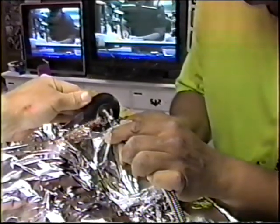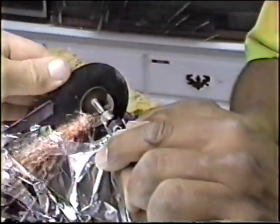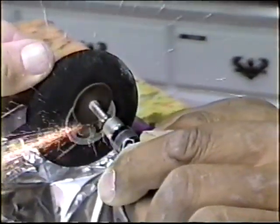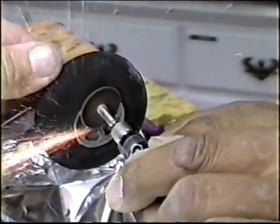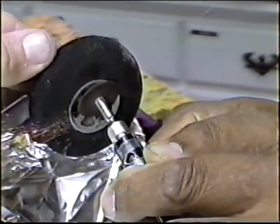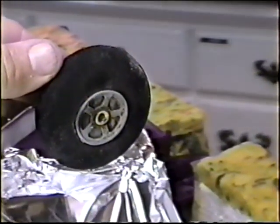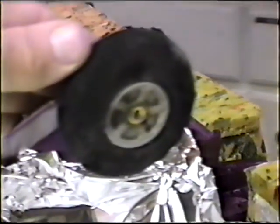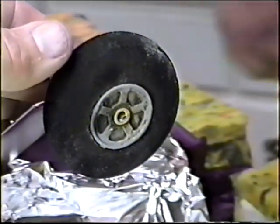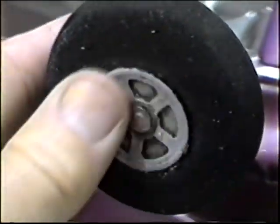Last time he did this, he cut his finger off. That's the heavy duty wheel. See how that cuts so nice? That's a good one. Doesn't that cut nice? Yeah. Just go slow, you don't have to go faster. Wow, the wire is so hot I can't touch it. Yeah, just burnish it off. Alright, let's see if we cut enough off. You got a couple thousandths of clearance? Yeah, we got plenty of clearance. Okay, that's good. The important thing is just to get a nice flat soldering joint on the eyelet so that I can glue that hub right to the edge of the Dave Brown wheel.